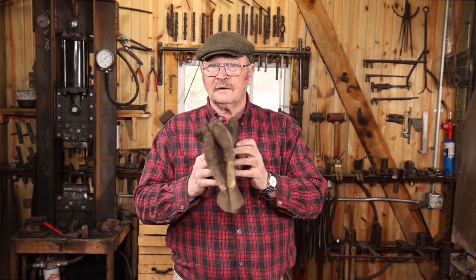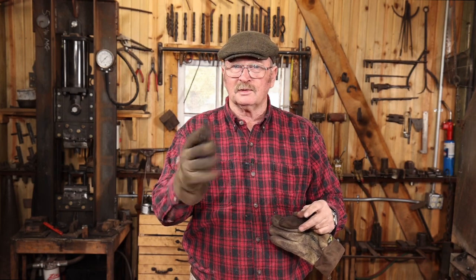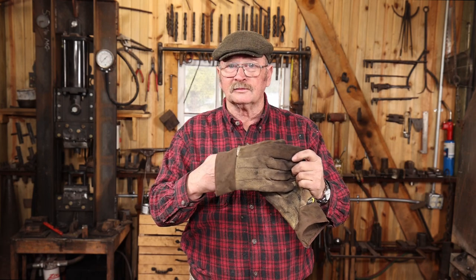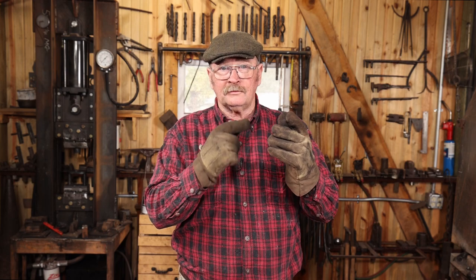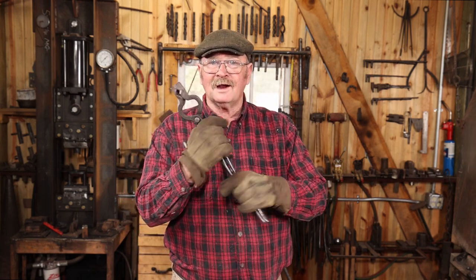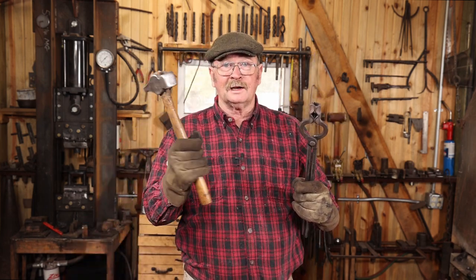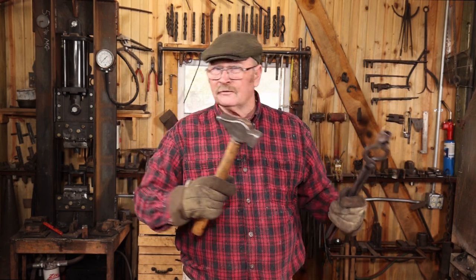So what gloves do I like to wear when I'm working around the gas forge with hot material? I like these Kevlar Hot Mill Gloves. These are available from most of the blacksmithing suppliers — there's a link in the video description along with a discount code for Blacksmith Supply. These things are a lot better insulation; they really protect your hand from the heat and heat up a lot slower than a leather glove. Plus, when you drop something hot because you shouldn't have grabbed it in the first place, these start to cool off almost immediately, so they don't really contribute to that severe burn. They're a whole lot easier to get off than a leather glove or the synthetic gloves. The problem is these gloves have terrible dexterity — they're really slippery — so it's a lot harder to hold onto things both in the tong hand and the hammer hand.